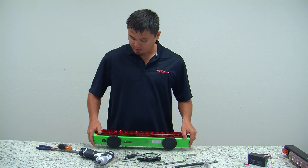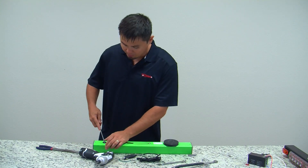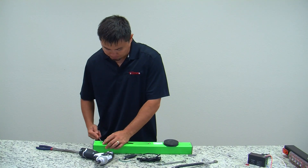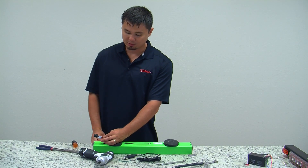If your light does not come on for any reason, the first thing you need to check is your rocker switch. By removing your rocker switch with a flathead screwdriver, you're going to want to see a double red and a brown wire hooked up to your switch.